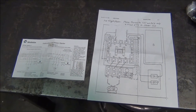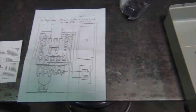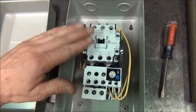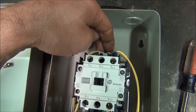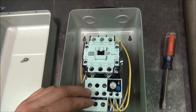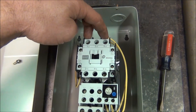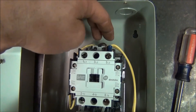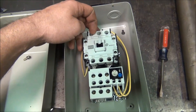These are the wiring diagrams that this thing came with. They're pretty rudimentary — you can tell they've been translated from Chinese. Fortunately, the magnetic contactor is a pretty simple device. You can think of it basically as a relay. You've got your contacts right here, and your control coil is these two connections down here. The pressure switch is going to apply voltage to that, which closes the contactor and sends power through the overload out to the compressor motor. So it's a pretty easy wiring job. I'll take line one and line two in from our main power and put it in here, hook the compressor motor up to these two, and hook the pressure switch up to these two connections. I'll run one line down to there and that ought to do it.